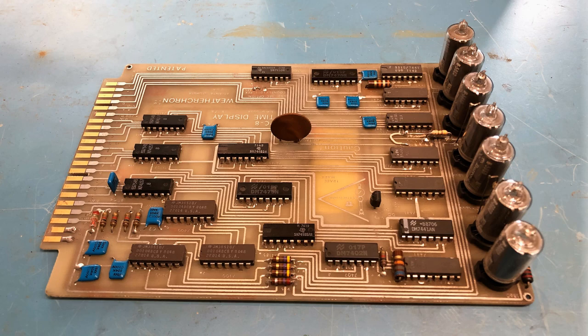Here's a different view with the part numbers right-side up. Pretty standard TTL logic: 7410 up here, 7475, the 7441 drivers. There appears to be a date code here — 42nd week of 1971 — and another down here from the 19th week of 1976, and another from the 48th week of 1971. We've also got a 45th week of 1975, so this board gets us up to at least 1975.